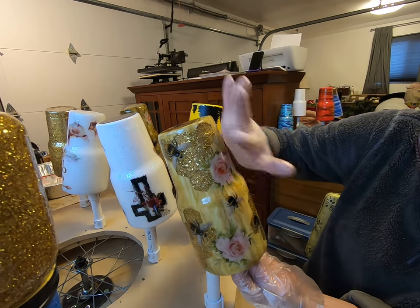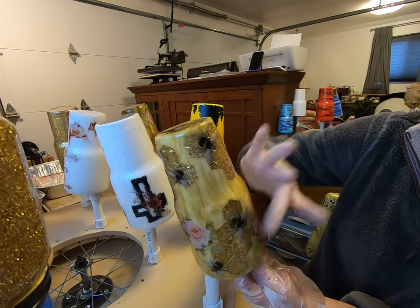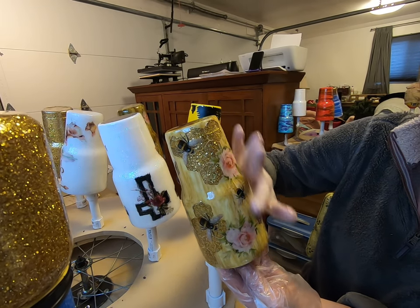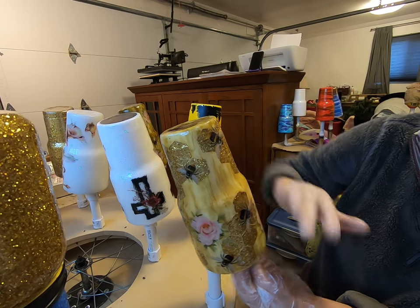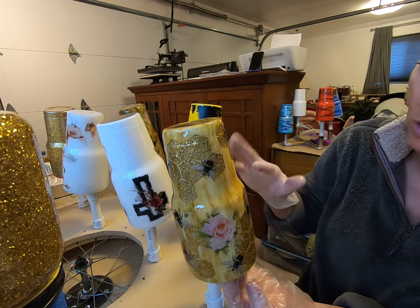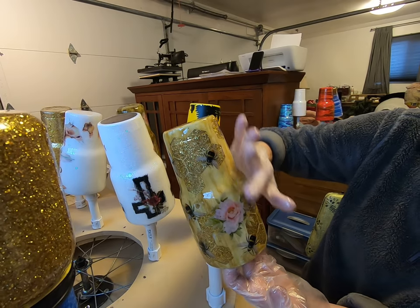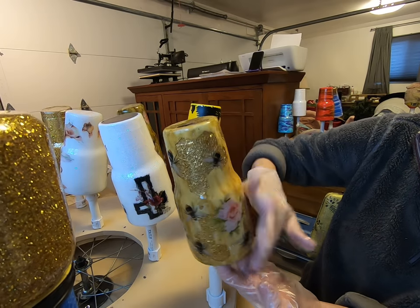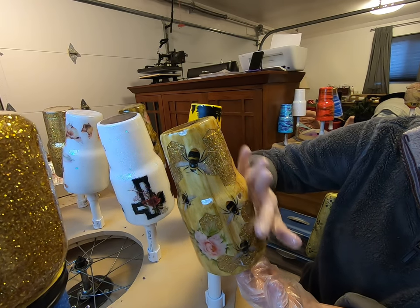You can use a little bit more if you want, but I don't recommend it because it will drip and then you've got to sand the drips. So for your final coat of epoxy, definitely make it thin. If you're trying to get it a little heavier, you can, but then you'll have to deal with swiping the drips off the bottom. If it drips on the bottom of the cup, after about an hour you'll start seeing drips — if you've used too much, just take a popsicle stick and slide it along the bottom to pull those drips off.